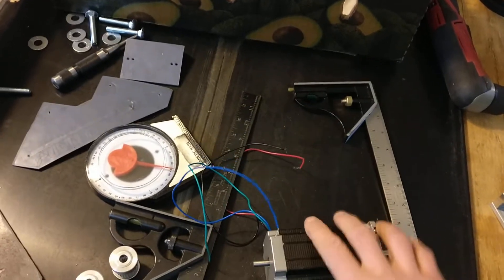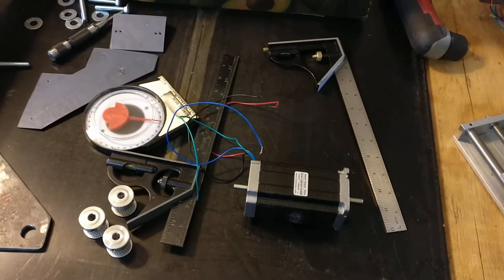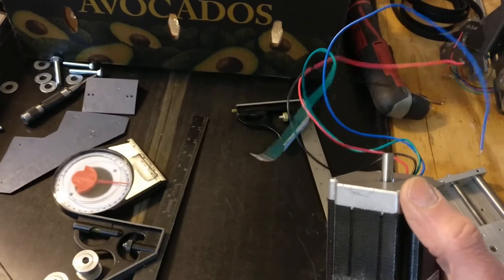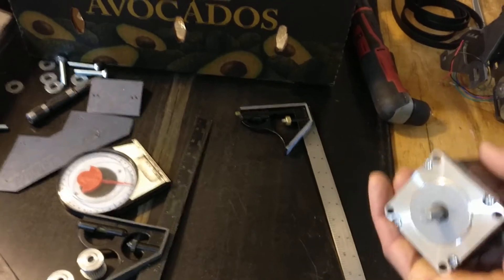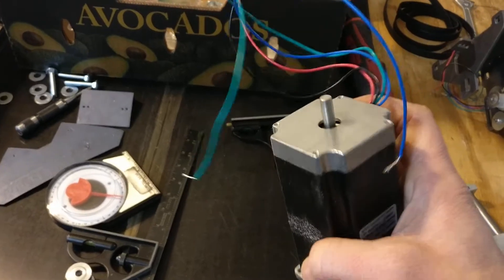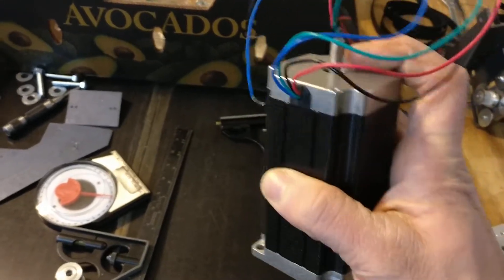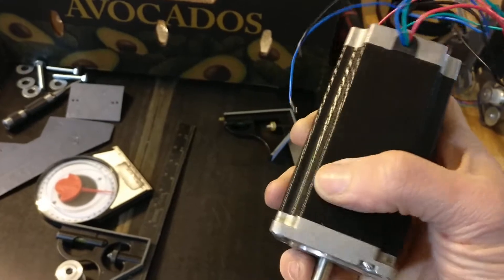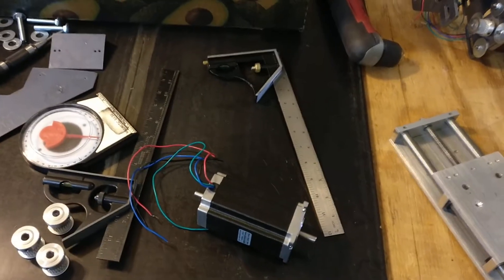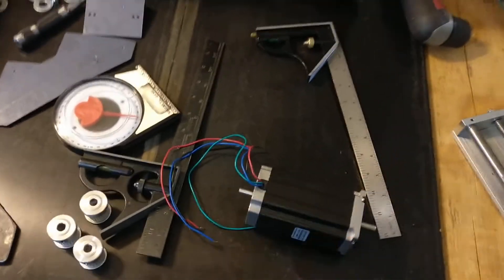One interesting thing about these motors is they're dual shaft. On one side you have quarter inch and the other side you have eight millimeters, and that is the part that messed me up. I saw that and thought I could pick my other linear drive components to match either quarter inch or eight millimeters and either would work equally well. But not so fast — the mounting plate is only on one end, and with the wire bushing and a slight difference in how the bearings are set internally, these two sides are not interchangeable. So when you buy the rest of your linear drive components in quarter inch, you basically commit yourself to using the motors upside down. While they're all dual shaft, one is definitely the primary shaft and the other is more second class.